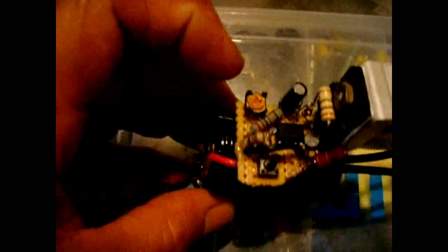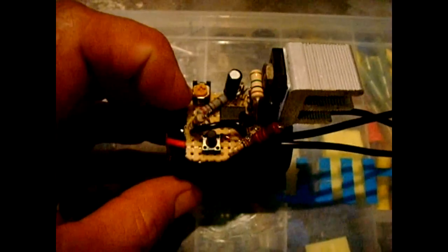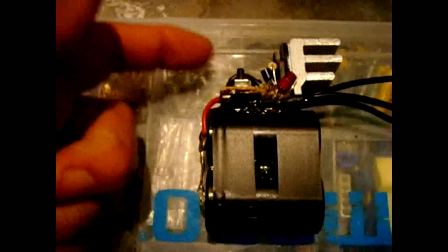So what this does — and this is only designed for lead-acid batteries — you set it right here with this potentiometer. What you do is you adjust the low-end cutoff, which would be like 12.1 or 12.2 volts. And what will happen is when the voltage of your lead-acid battery reaches that level that you set with this pot, the circuit will actually open up the MOSFET and the load will be disconnected.